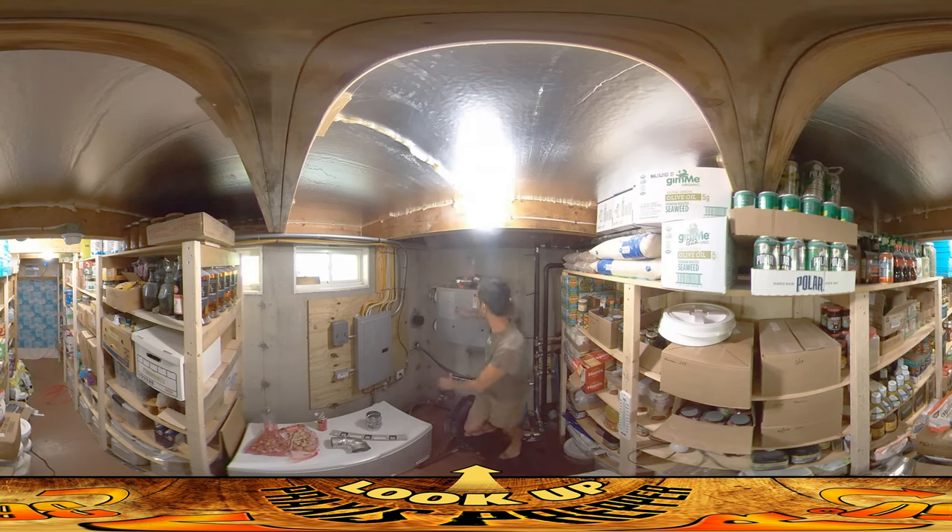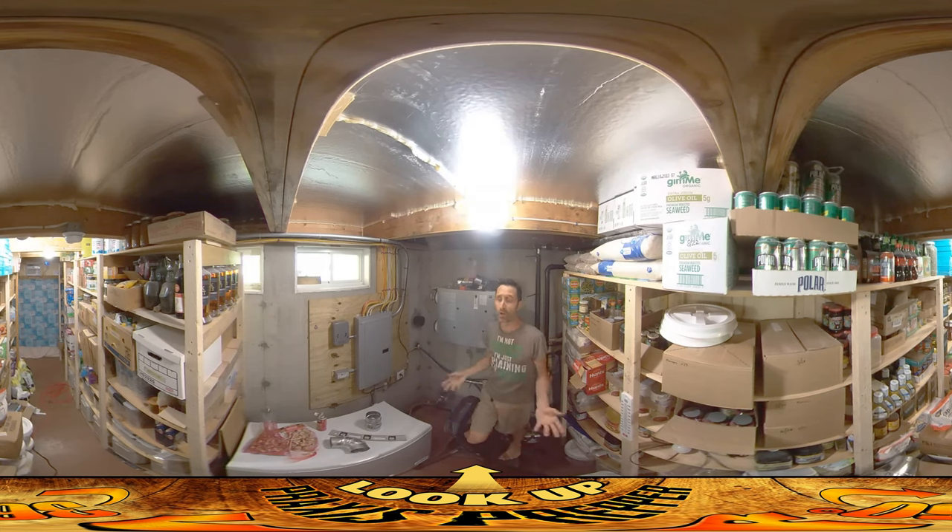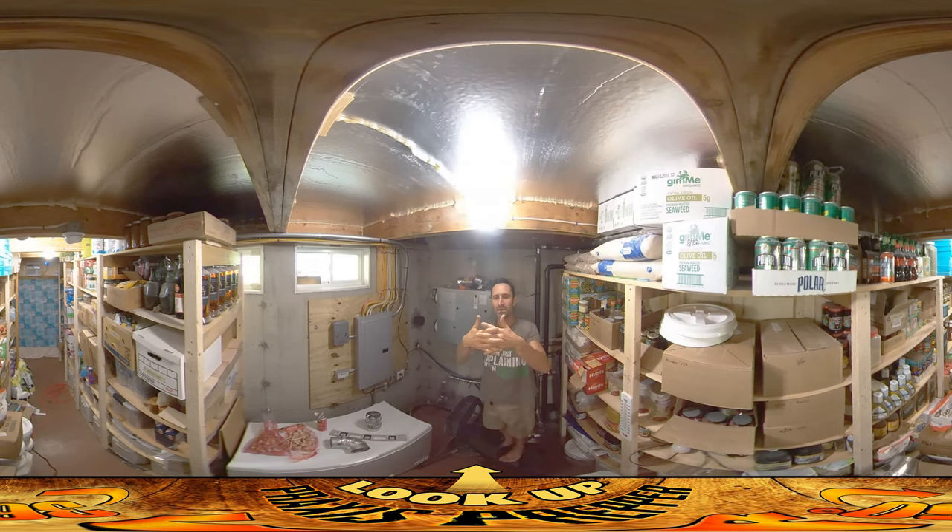So this is the air exchange unit — we're going to be hooking this in. The purpose of this thing is that you need fresh air all year round, but specifically in the winter when you have your windows closed, you can get a lot of carbon dioxide building up from people breathing. We've got the wood stove here, so gas can come out of that occasionally. So the purpose of this is that it intermingles your waste air with your fresh air and tries to extract the heat from the stale air and put it into the fresh air as it comes in — there's kind of a manifold where fresh air is coming in and hot air is going out, transferring as much heat as possible. Fresh air comes into the unit right here, which is why I lined that hole up there.